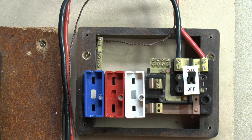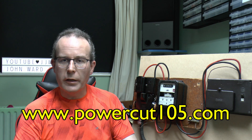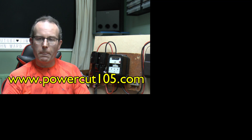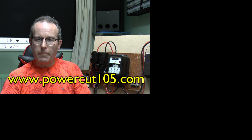These are very common even now, either with a wooden back or the plastic ones, as they were fitted literally in their millions over a period of several decades. So to look at a typical installation there and which parts belong to who: the DNO owns the incoming cable and cutout - if you need to call them, just call 105, and that will connect you to the right place automatically. The metering equipment in the middle is the company you're buying the electricity from, and anything else beyond that is your responsibility, or the landlord's if you happen to be renting the property.